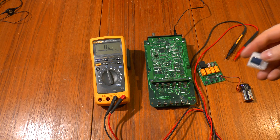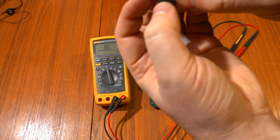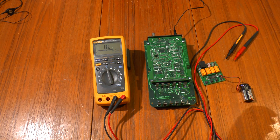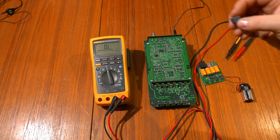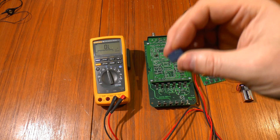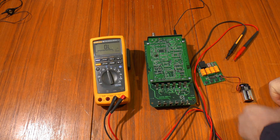I have a replacement right here. This is the five volt version. There are six volt relays on the board. RS don't sell the six volt version; Mouser do, but I wanted to order from RS anyway because I'm ordering this through work. So let's change that relay out. If I take the relay out first, I can test it out of circuit just to confirm that it is definitely broken. And we'll take it from there.